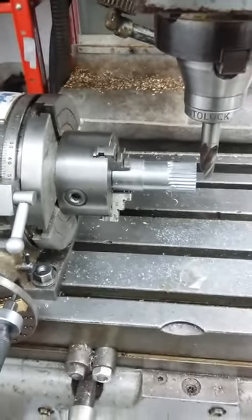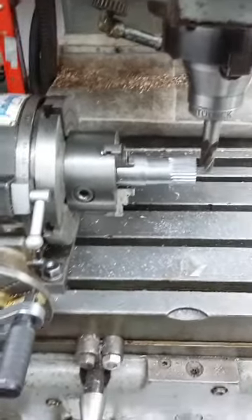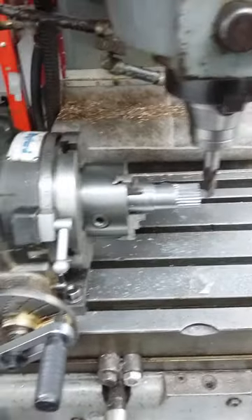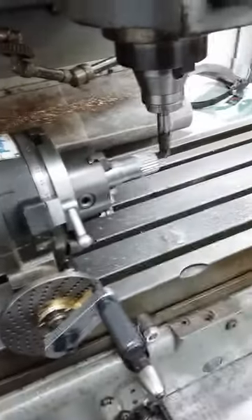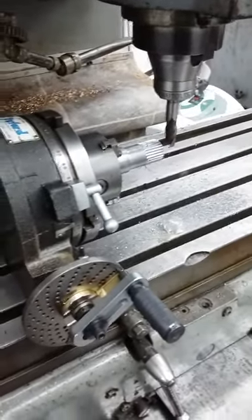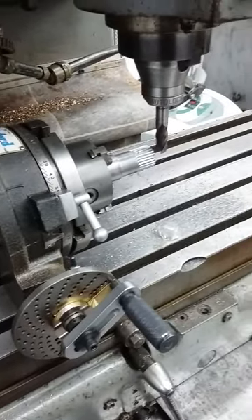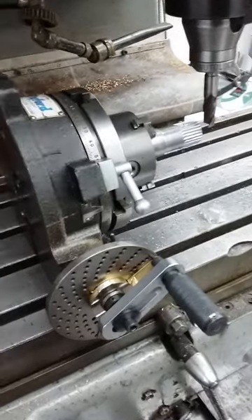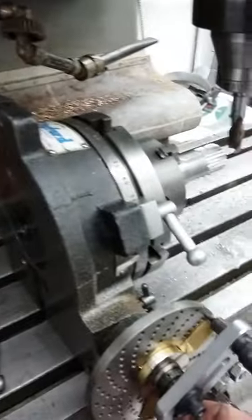What's significant now is that I'm going to run through and show you how the cut goes. It's going to be pretty wobbly, I imagine. But we're using a rotary table, and because it's a 25-tooth spline, that means we need to rotate the table 14.4 degrees for every slot. And of course, you can't really do that by just winding the ordinary handle, so we have a set of dividing plates on here, which are designed for the job.